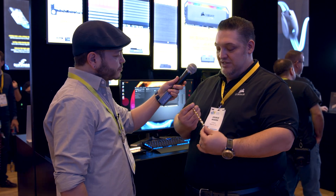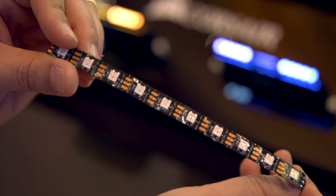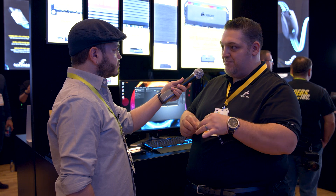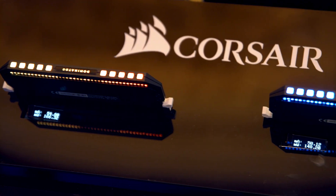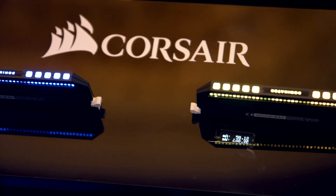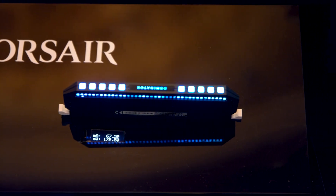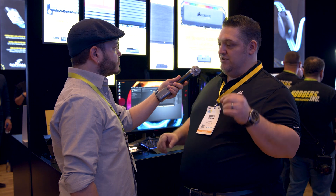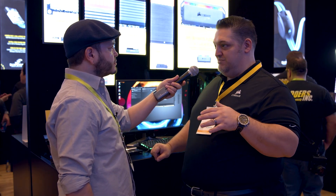So this is a typical LED — a light strip here — and this has got a little diode on it. Basically that diode is in the center of a lens with a housing, and then there are solder points and it's all mounted to the PCB separately. That whole package looks really small next to my finger, but when you talk about something on like a memory module, it's actually somewhat large. There's not a lot of space. So what we did is we went and found a partner and developed some really small LEDs. We got rid of the housing, we got rid of the lens, we got rid of the solder points, and just mounted it directly to the PCB substrate.